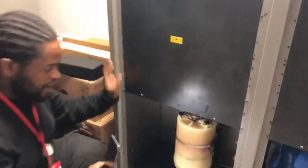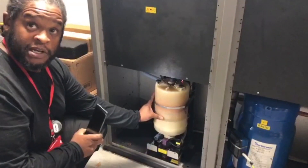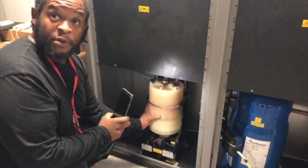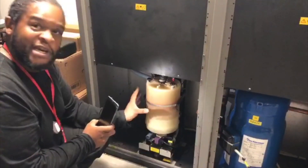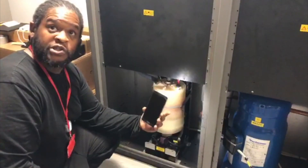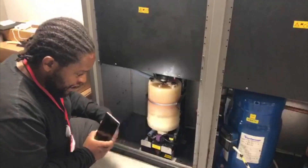The humidifier needs replacing. As you can see, it's had a lot of wear and use — a lot of scale build-up. I will not be running or testing this for health and safety reasons; we just replace the bottle and start again. I've mentioned this to the facilities team on site, and they've spoken to the Head of IT who said humidity is not really a big issue now, because servers don't really take static charge like they used to. I think we should still replace the bottle anyway — and if they want to use it, it's there.